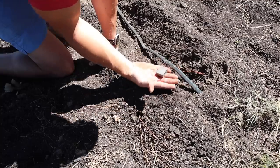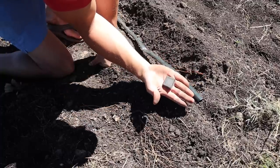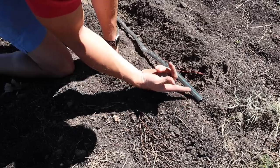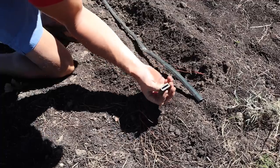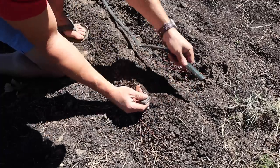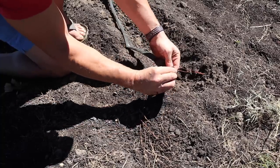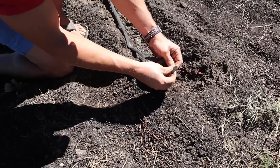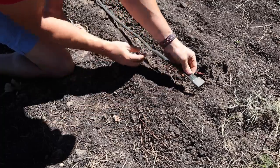And there's several different fittings available for doing this. Some people will just tie it in a knot. I've always had pretty good luck with these, but some people have fits with these, and they'll use something that looks kind of like what we use to plug the main line with. For these right here, you have a wide end and a narrow end. We just insert it through the narrow end, and then we fold it over a couple times, and then push it through there, and it just cinches down like that. So that's the complete install.